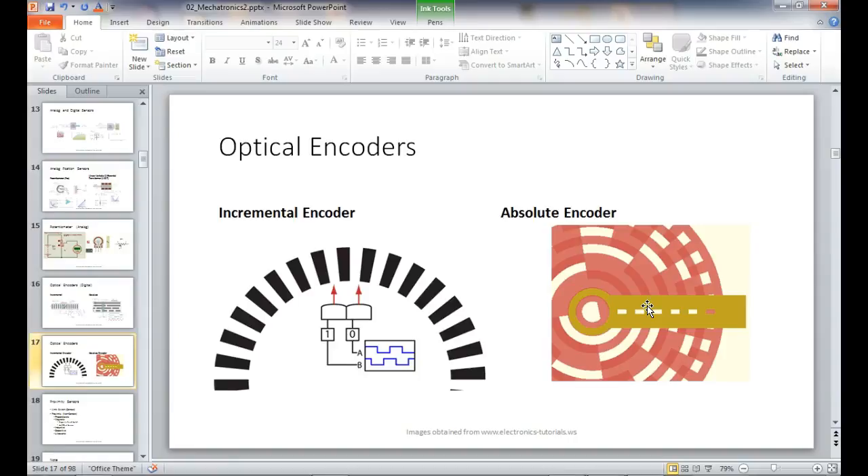You have to realize that manufacturer's origin might not be the origin you decide to use. The Fanuc robot we have in the weld shop has a torch mounted on it, and the factory origin for Fanuc robots is basically at a 90-degree angle. The problem is if you put it at 90 degrees, the back of the torch could hit the robot. So Lincoln sets their origin differently and puts a secondary scribe mark on there so you can still line up.